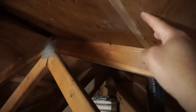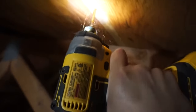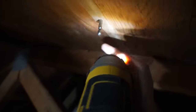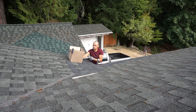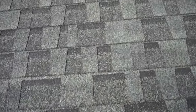I'm going to mark where the vertical is and estimate right there. I'm only going to cut it once we get the exhaust vent tubing inside. I'm actually going to leave the drill bit right there in the roof decking so that when I go up on the roof I know exactly where this location is. Once on the roof you can see where that drill bit is sticking through.